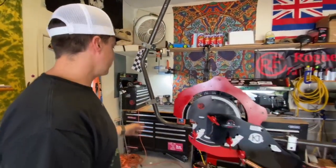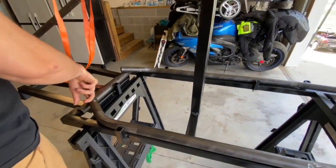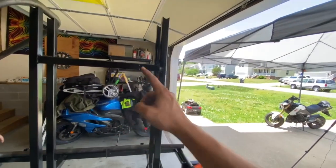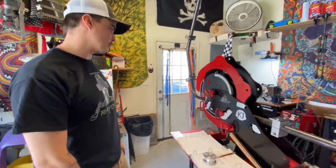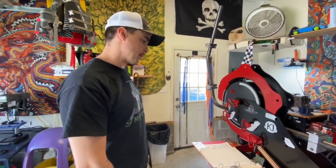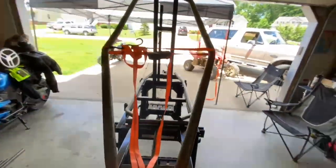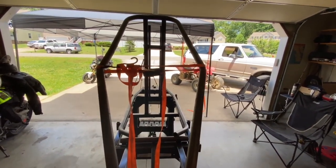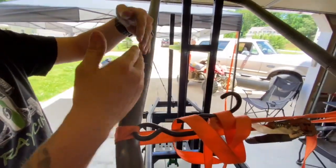We're on the main hoop right now. We already bent a couple of floor pieces this morning, so we got these two pieces bent. They haven't been notched yet so they're not fitting perfectly. This one should line up from about halfway, goes around the rear part of the jig and then back down. Getting more comfortable with the bender, making pretty accurate bends, figuring out the spring back angle. The fitment is not too bad now — everything looks pretty even across compared to what it first looked like. These two pieces are supposed to be straight together because they're going to get butt welded.